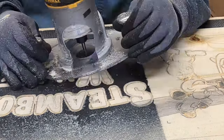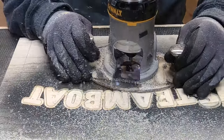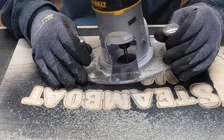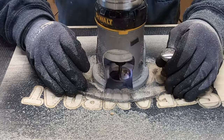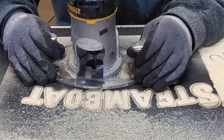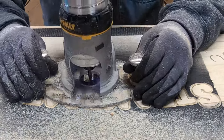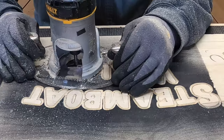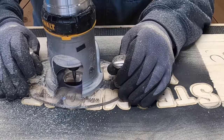There's an area where there's a knot between the I and the L, so dad's actually carving on the edge of a pretty good-sized knot. If you can avoid this during layout you definitely want to try, but sometimes there's just no avoiding it unless you use a different board. If you're carving through a knot, just be careful — number one it can chip out, and number two it might have a different density than the rest of your board.